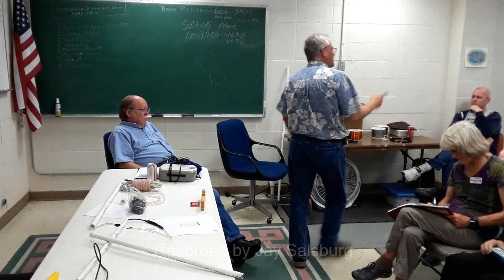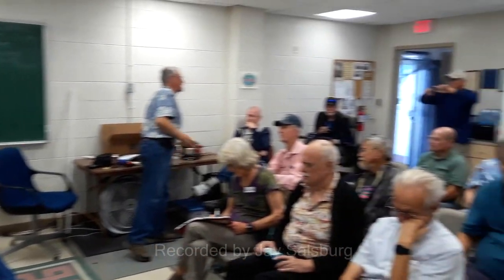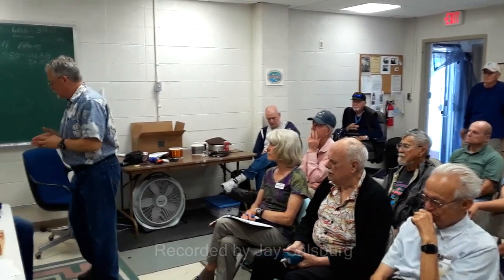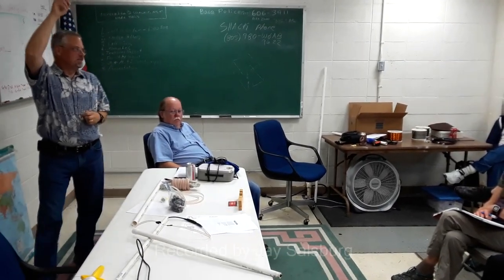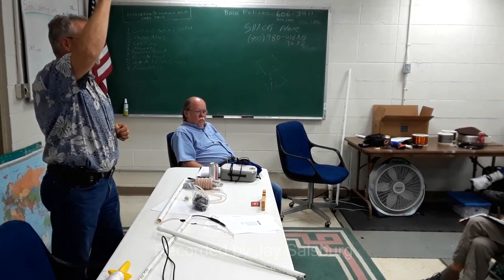You mentioned the radiation pattern. Is it the double O? What does that look like? It looks like a bagel or a donut. Now, the J-pole is a little bit distorted because it has that J at the bottom. But for all practical purposes, it looks like a donut, aiming around the horizon. So that basically says you're not sending very much signal off the end, right? So it's not going to be very good for satellites.